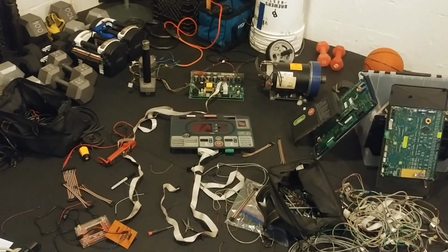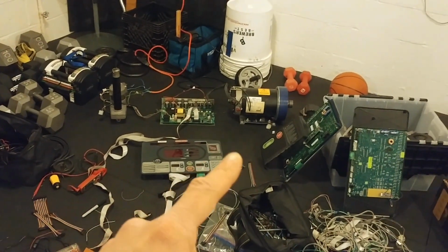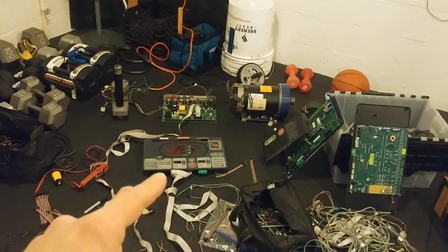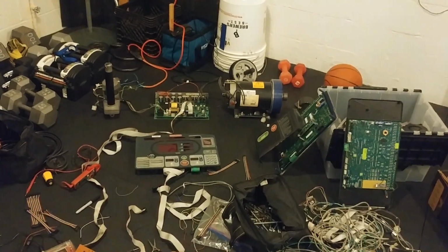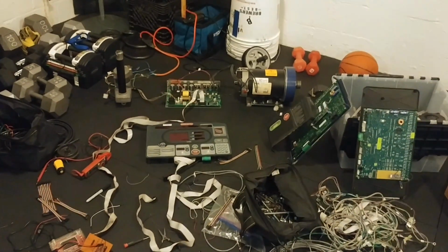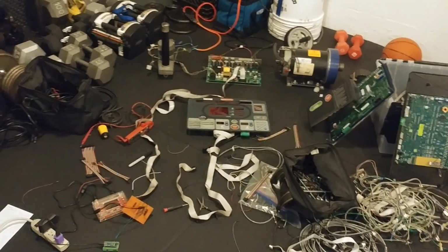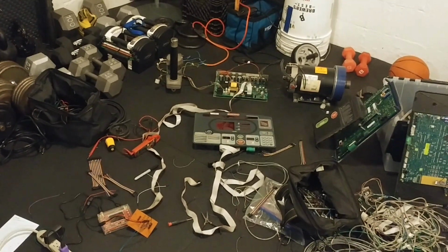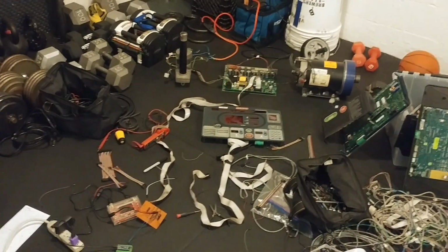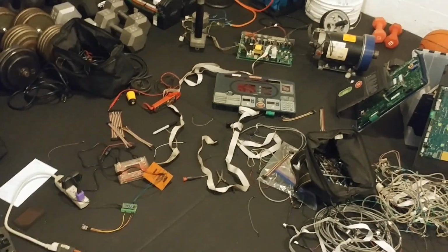There's more left for later, like with the lift motor there. It's currently detached, and the main motor will run now with that detached and the display out of the loop. But I want to figure out how to run that on its own later on for other projects I have down the pipeline. For the time being though, I'm going to put some of the files related to all of this up on GitHub. Things like general notes, the PCB layout for that breakout board, the Arduino code, and that kind of stuff.